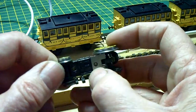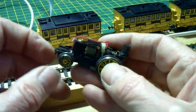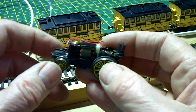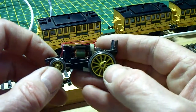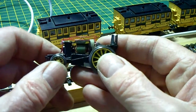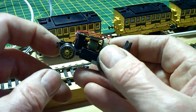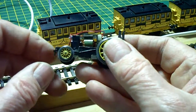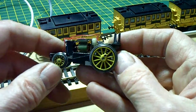I've also tried to remagnetise that magnet. The problem with the old Trix motor was basically the magnet. I did clean the motor up and tried to get it running — which I did — I got it running perfectly well outside of the locomotive. But it just wasn't enough power to drive the wheels. I would guess that's probably down to the magnet inside the motor. I did try to remagnetise the motor and got it running a lot better — originally it didn't run at all — but basically I just couldn't get it running well enough to drive the locomotive along the track. Hence the search for an alternative motor.